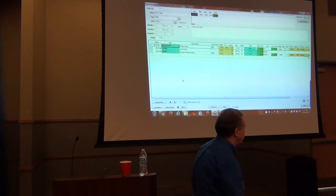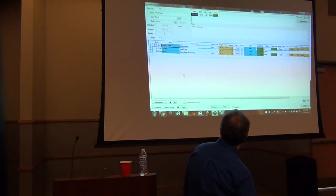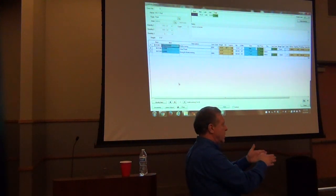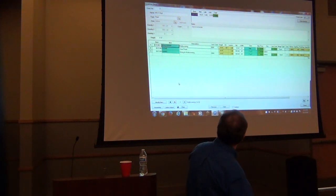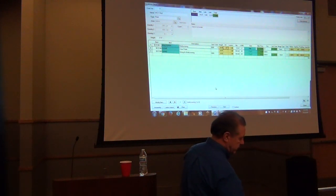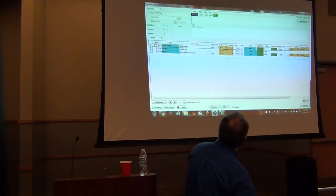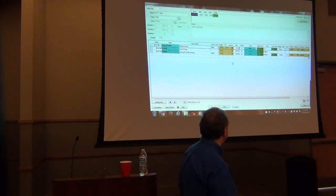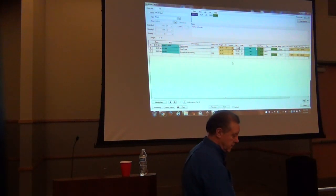And so I experimented with this in the program when I first came to work for On Center, and I realized, okay, it's an object that goes vertical the whole distance of the wall. So I basically told the program to break it into vertical 50-inch wide strips. And it worked. And a 54-inch commercial roll of wall covering, you get 50 inches of yield. So I said, okay, take the total length times the height, 50 inches on center, it figured 76 lineal yards. I got some real happy painters out there when they saw that.